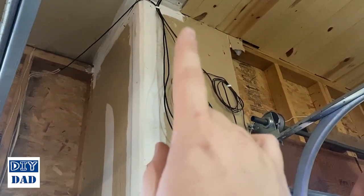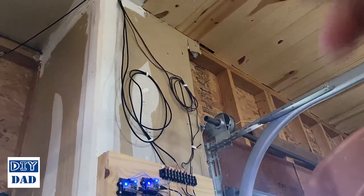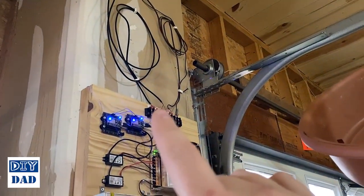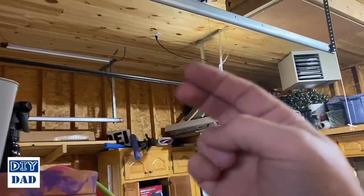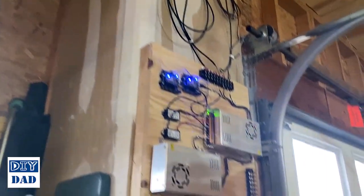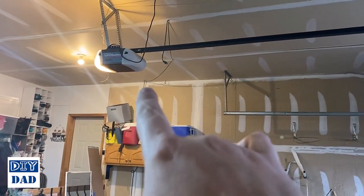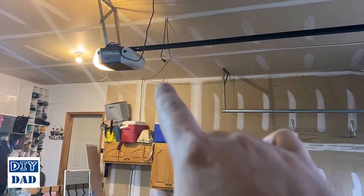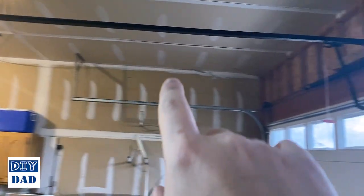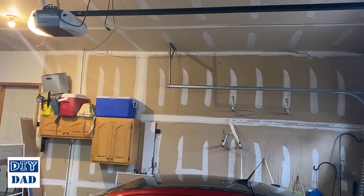I have a power injection point I want to do right there but I don't have an easy way from the attic to get out into the soffits. So what I ended up doing is running that power injection point up and out along with the secondary data wire — it comes out in that corner of the garage and runs behind the existing lights around the corner to get there. The other power point I needed to connect, which I can access from the attic, is right about there, and because I needed a connection point there that's actually where I start my install. My lights actually begin there and worked their way along the side of the garage so I knew I'd have an end point with injection wires I could connect into easily.